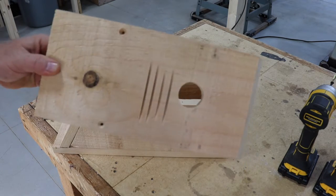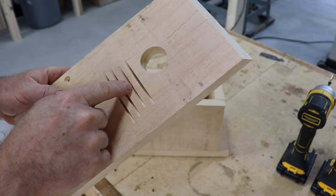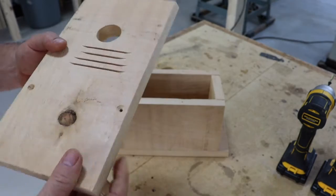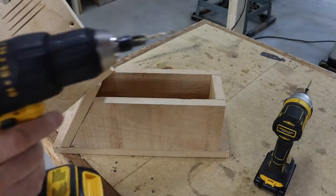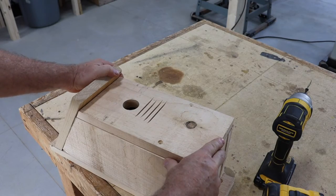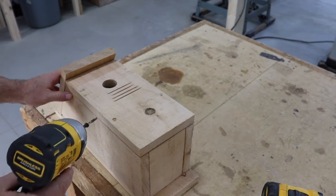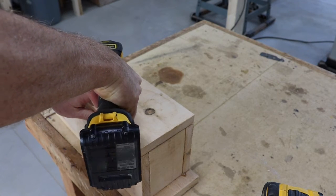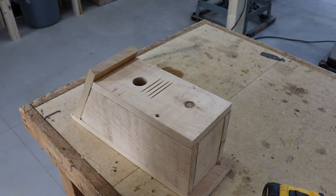The glue's all dried up. You obviously have to put a hole in the front — I'll show you how to do that in class. I did it with my miter saw but we can do it with hand saws as well. Very important: because the holes are so close to the edge of the wood, you have to put pilot holes in first. I'll bring to school what's called a countersink — put it on like that, make sure it's lined up, then put your screws in. Don't go in too far or you'll still split the wood even with the countersink. Alright, guys, have a good time!